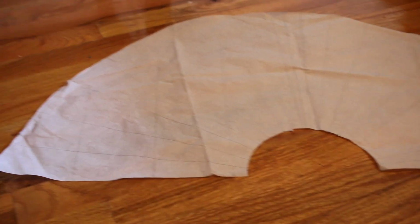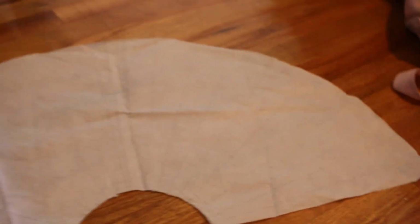So once I have my circumference, which is 20 inches, I divide that by pi to get the diameter. So 20 divided by 3.14 is 6.369, and so on. Round that up to 6.4, which is 6 2/5 inches.